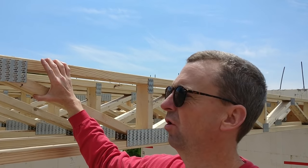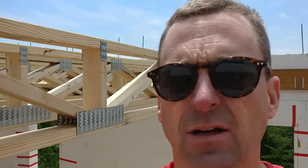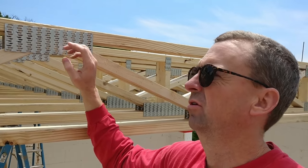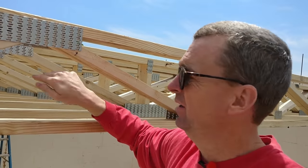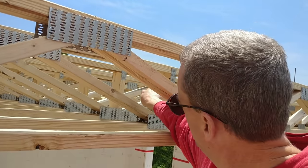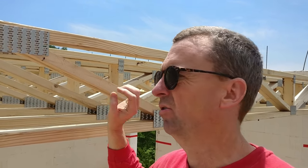The joist hangers will hang on the wood just like regular wood framing. The web joists are really, really strong, and what they allow is that if you have ductwork, you can go right through there — you don't have to cut any holes or weaken the joist. If it's a wood I-joist and you cut a hole in it, that hole has to be centered, can't be too close to the edge, and can only be a certain diameter or you weaken the structure. These are much stronger and they have the openings already done. So if you have wire that needs to go into a corner, you can literally zip it through all of those — makes it really easy. I strongly recommend this style of floor joist because on the back end when you have to put all your mechanical, electrical, and plumbing, it's much easier.